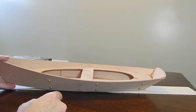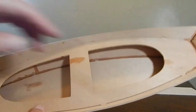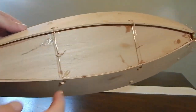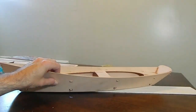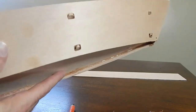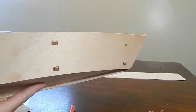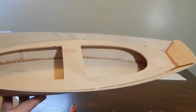Finished the epoxy process — it's all been glued up, got a little bit messy here and there but all of the major seams are glued up. Now I can remove the copper and see if it holds together. I've removed all of the copper stitching and the boat has held together. Now I'm going to get started on the sanding process — going to have to do some filling. I picked up some wood filler, I'll be filling this in, sanding it down, and getting it ready for paint. Got some pretty cool paint colors I think are going to look good on this.